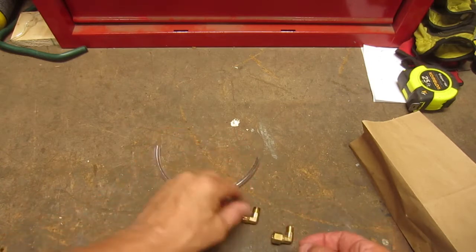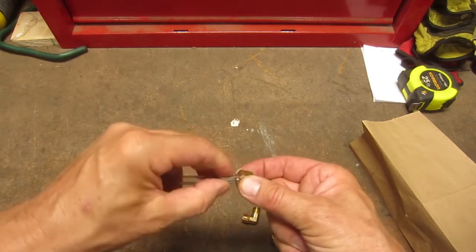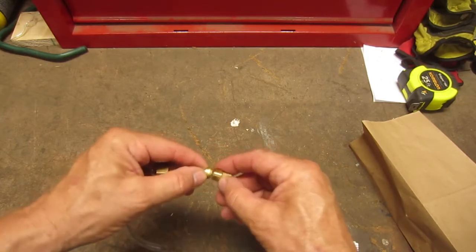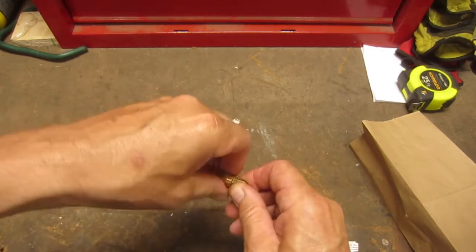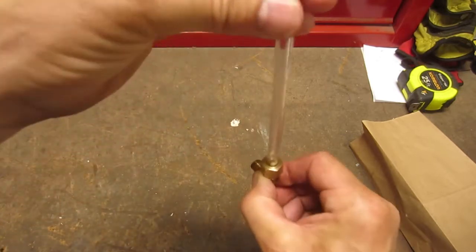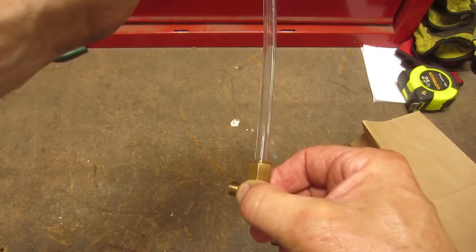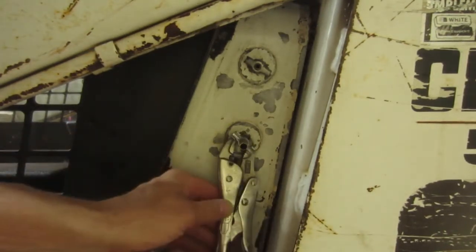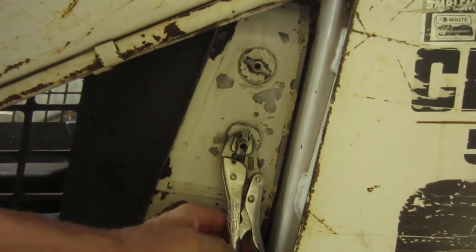Let me show you how this goes together. I'll get these first installed on the Bobcat, then we're going to slip the nut over, this compression collar, and put that back together. This will be my gauge — pretty cheap. It's the perfect time to do this job because I'm low on hydraulic fluid, so I don't have to worry about this stuff leaking out while I'm changing the fittings.